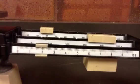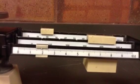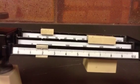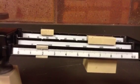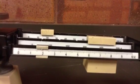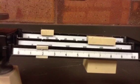If you look at the back beam, it goes up by 10 grams at a time. The middle one, which has the largest rider, goes up by 100 grams at a time. And the front one, which is the smallest, goes up by 0.1 grams at a time.